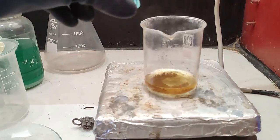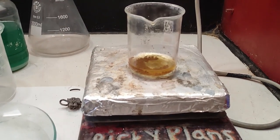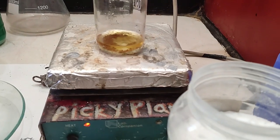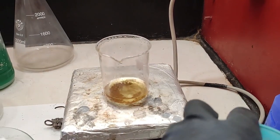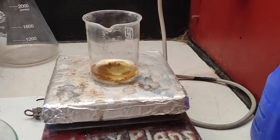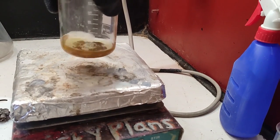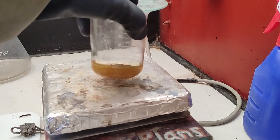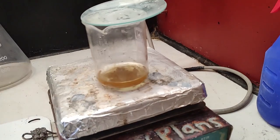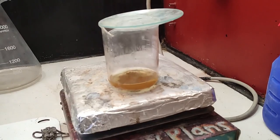In order to fix that, I add a few drops of ammonia to provide some ammonium in this solution, and just a few milligrams of oxalic acid. This will prevent gold from being dissolved in this low quality hydrochloric acid. SMB is good for this purpose, but I don't want to dilute the hydrochloric acid, and when you add SMB in powder form, it makes lots of gas that may not dissolve properly in solution. But oxalic acid dissolves in solution and works slowly while the gold powder is being cleaned.